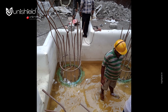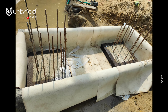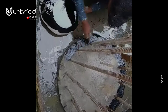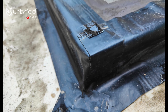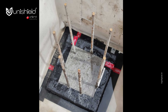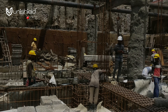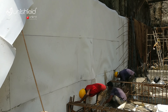Cap or pile head treatment: the pile head treatment will be done by placing HDPE membrane around the external circumference of the reprofiled pile heads, which are treated with bitumen primer. The membrane shall then be overlapped with SBS membrane, which shall be continued on the vertical face of the circumference of the pile head and subsequently affixed on top of the pile head footing to secure against any leakages.